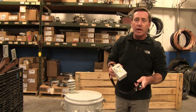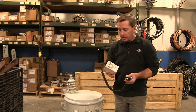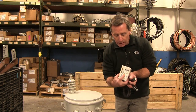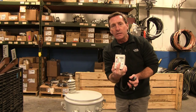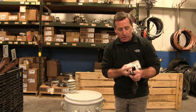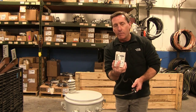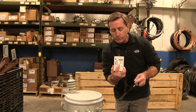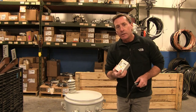On our 6793, we'll go through a pre-check to make sure everything's working properly. We're going to leave the leads in the clear. I'm going to hold the button down for about four seconds — what I want to see is an open. I've got an open read on there. Now I'm going to go ahead and attach them together, hold the button down for about four seconds, and I want to see it short. My unit's working properly. I can go ahead and connect it to my transformer.